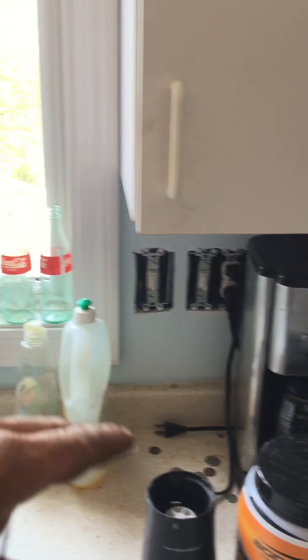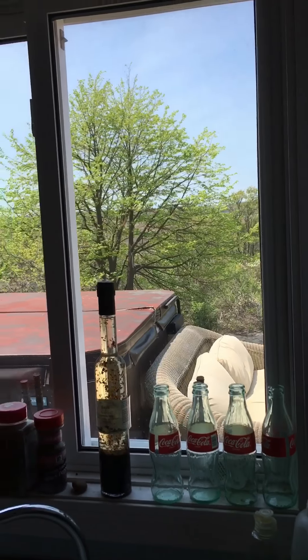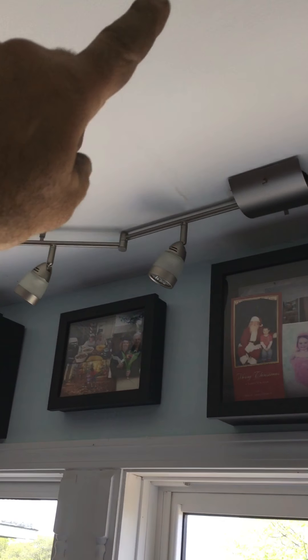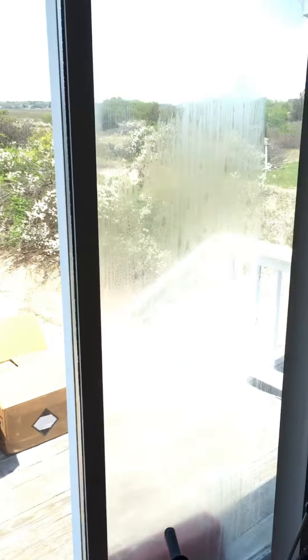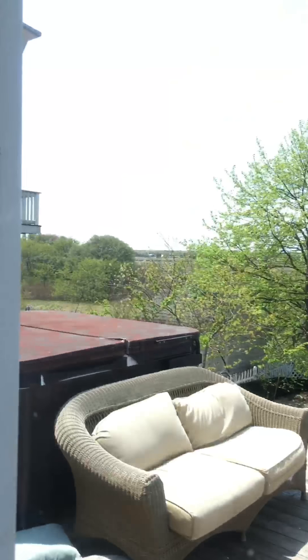The reason for the jack and header is that it's going to carry the load of the bridge above, and also the floor load — the third floor framing has to carry on down through this opening. This door comes out, this gets closed off, and then there's going to be a staircase that comes down from the basement level up here, and then from this foyer entrance area another one going up — all the stairwells follow each other.